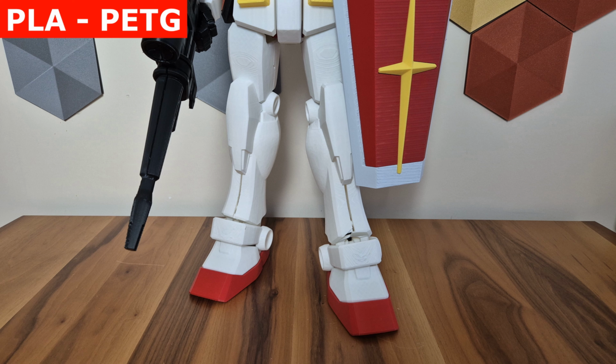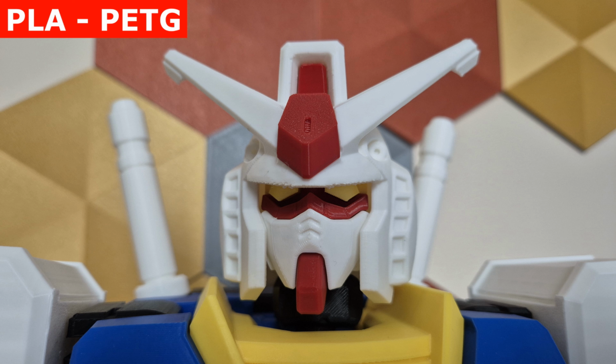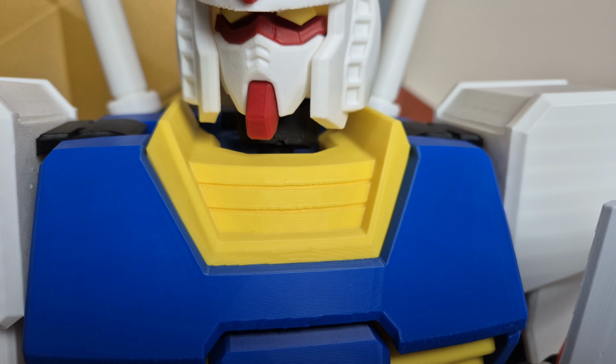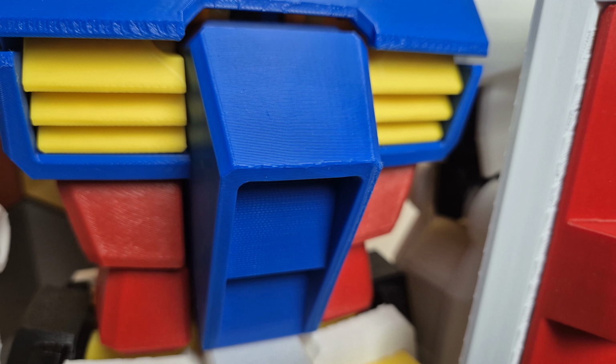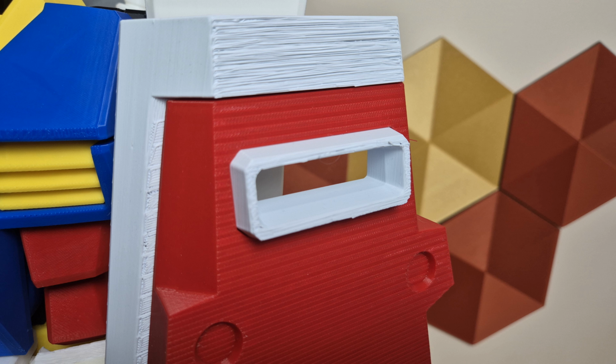I printed all the parts using the standard settings in Creality Print. When you select the high-quality profile with a 0.2 mm layer height, the printing speed varies between 80 and 200 mm per second. Of course, this is below the printer's capacity. But I wanted a flawless model, and it gave me exactly that. After all, my goal here is not to conduct a speed test. It was to show what someone using the printer for the first time could achieve with standard settings without adjusting anything. Even the support settings were completely automatic. I only loaded the filament, and I positioned the parts on the build plate.